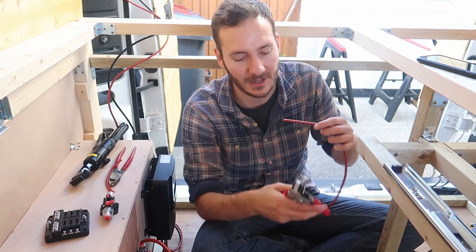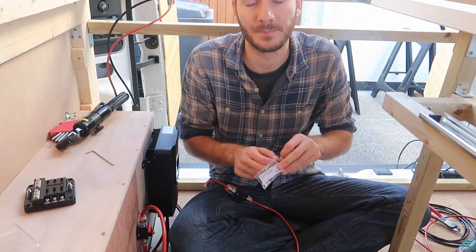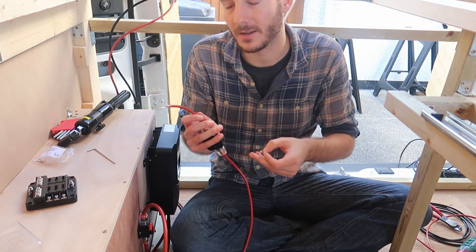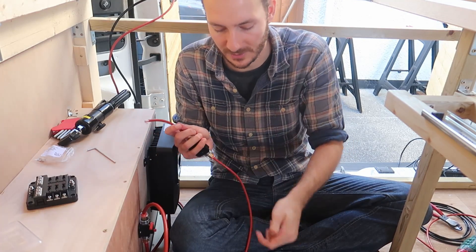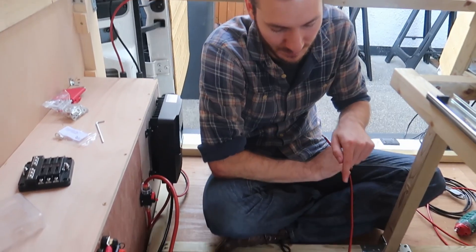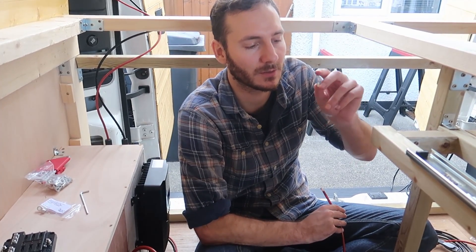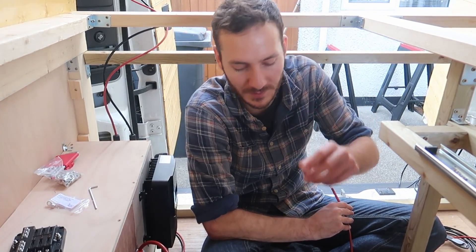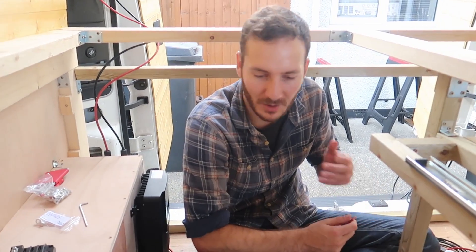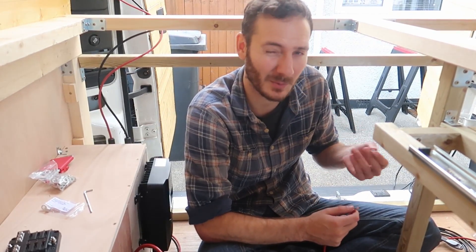With the 35 and 16 mil wire we didn't have wire strippers big enough, but because this is 10 mil we can go back to using this tool. There's our breaker connected and now I've got these little end terminal connectors to put on the end of this wire — one will connect to the fuse and I need to put a big one that connects to the battery. We needed to find one that was for the 10 mil cable but with a hole diameter big enough to fit on the terminal. When it comes to the electrics, we thought it was going to be a lot more complicated than it was — the most complicated part was just figuring out the connections and buying exactly what we needed.